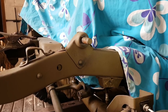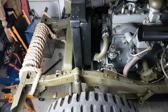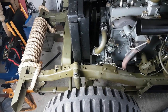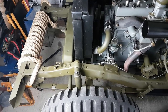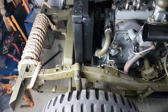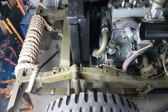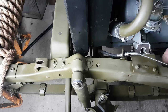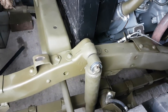Here she is with a bit of paint on her. From two feet away you can't really tell it's been repaired, which is what we're going for — a field repair really. Purists will say it's awful, but it keeps the original look and maintains functionality hopefully for a long time. At the front, the huck rivet which was loose has a blob of weld underneath — it didn't take particularly well to the under portion of the huck rivet, so I'm not sure what they're made of. Around the side and back there's a bead of weld going all the way around holding it as it should be, and towards the rear huck rivet there's a fat bit of weld reattaching the portion of the tab which had broken off — it still looks like a huck rivet so you can't really tell.